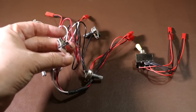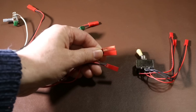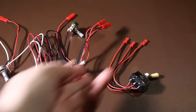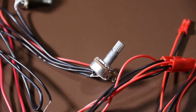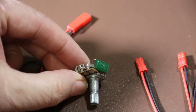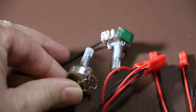The wiring loom looks all intact and ready to go — everything is soldered in place quite neatly, with the jack plug, volume and tone controls, and pickup selector switch all wired up. The main loom has five plugs: three go to the pickup selector switch and two go to the pickups, so you don't need to solder anything. You can tell the difference between tone and volume controls by the capacitor — that little green blob soldered onto the side of a pot is what makes it a tone control.